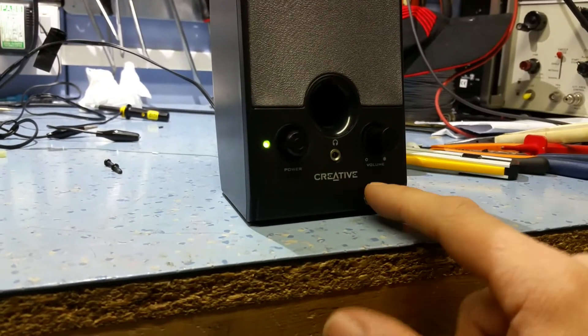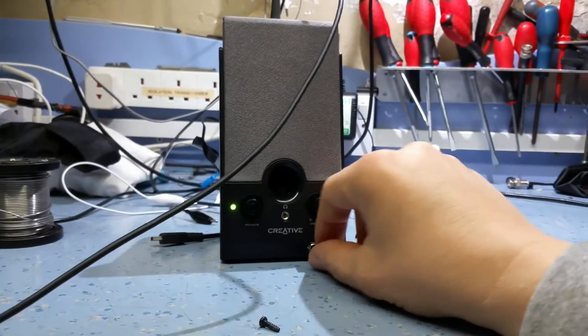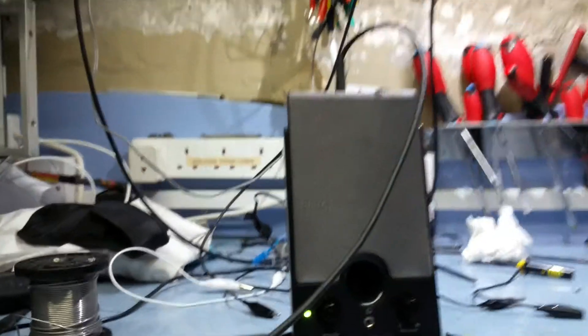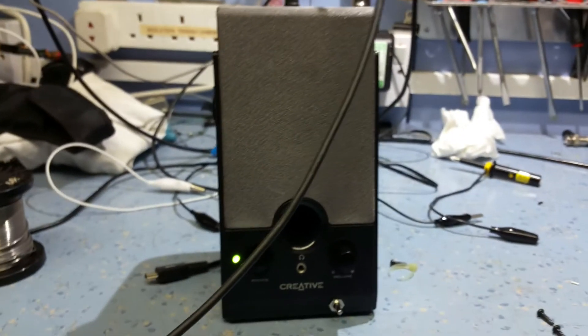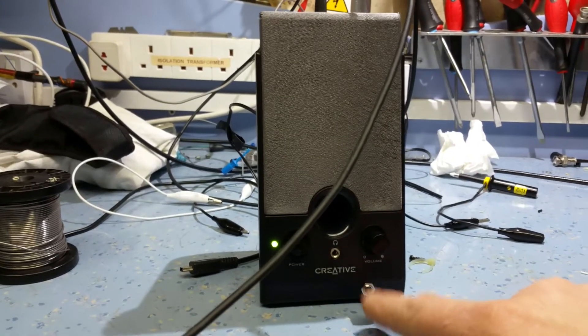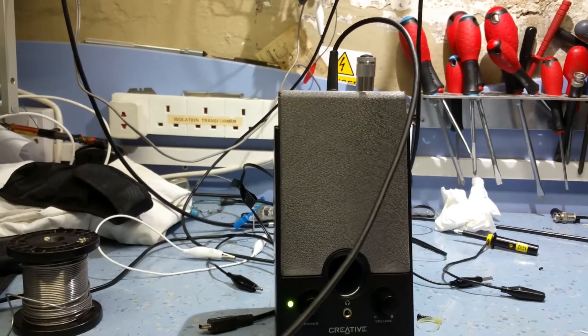You can hear the diode mode introduces a bit of noise, which you'd expect because the diode makes the impedance a lot higher. So what I'll do is plug it into the Rohde & Schwarz RF signal generator. Now I'm going to modulate the carrier — we're generating 770 kilohertz. And if we go into diode detection, you can hear the background. It's not that clear because the level is quite low, but there's a bit of interference from the camera by the sound of it. You can hear it's working fine as a diode detector.